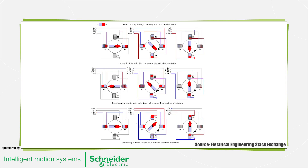This makes them slightly offset from the next electromagnet, so when it is turned on and the other switched off, the gear moves to realign. This continues with the energizing and de-energizing of individual electromagnets, thus creating the individual steps of motion.